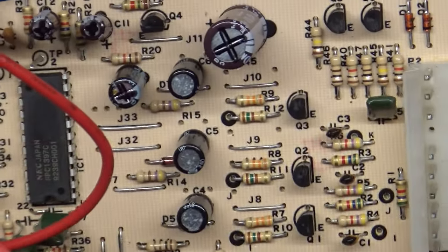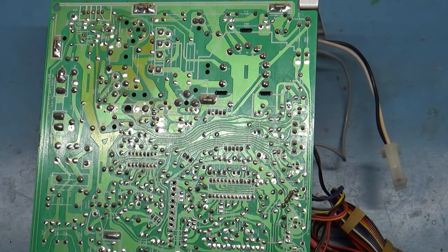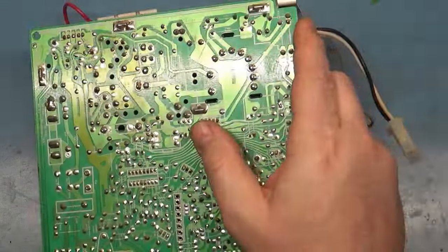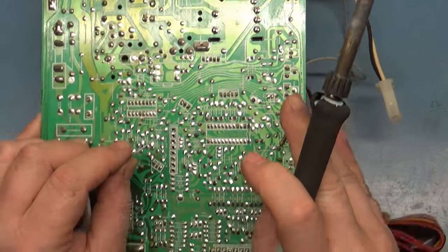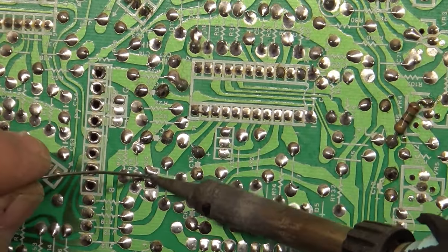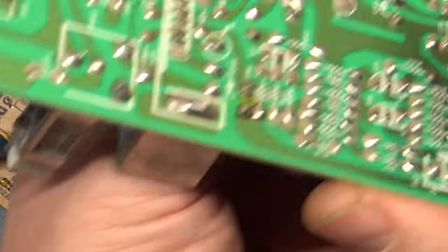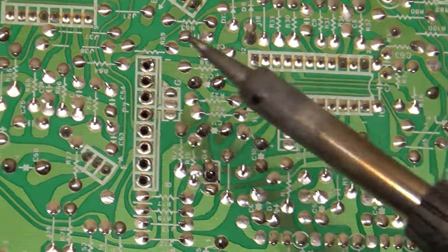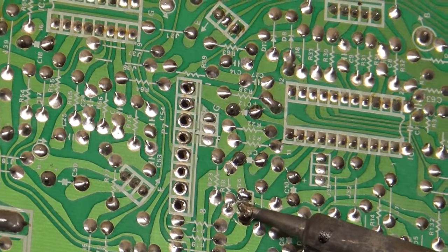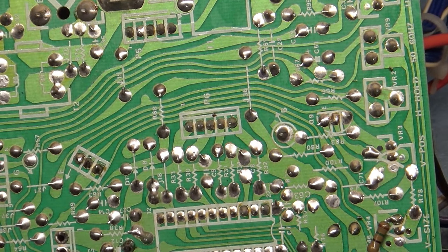Q4 comes out. These three bipolar caps need to move to the other position — there are two open spots above each of them. We take these three bipolar caps and shift them up one position to those empty spots. Then we remove the jumpers at J8, J9, and J10 and move them to the upper spots as well — just like the caps. Then in the original positions where these jumpers were, we install 680 ohm resistors. The easiest way to remove Q4 is to add a bunch of solder directly onto the Q4 legs, heat those pads up, and pull the transistor right out.